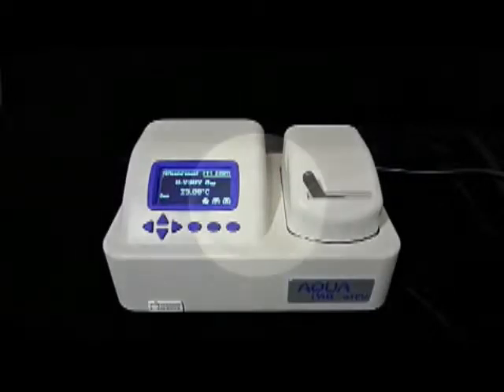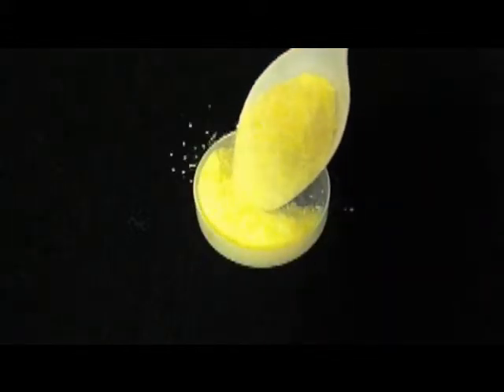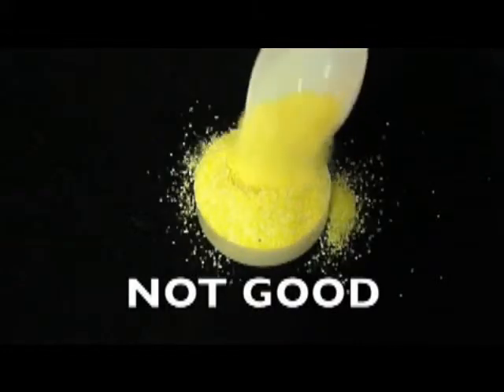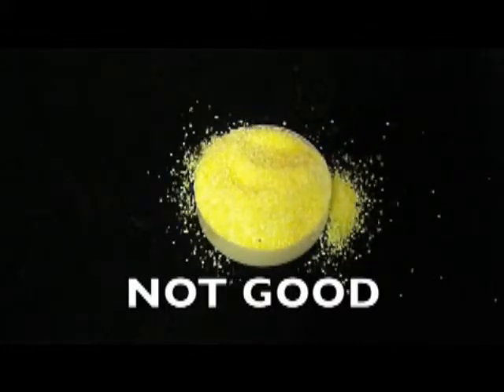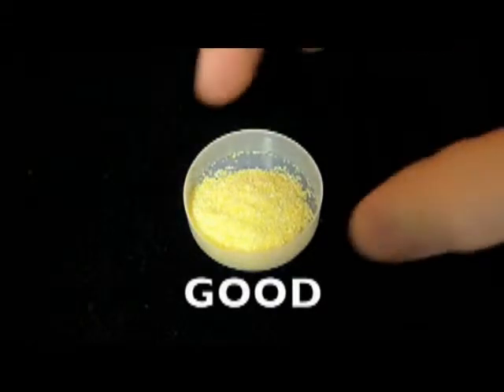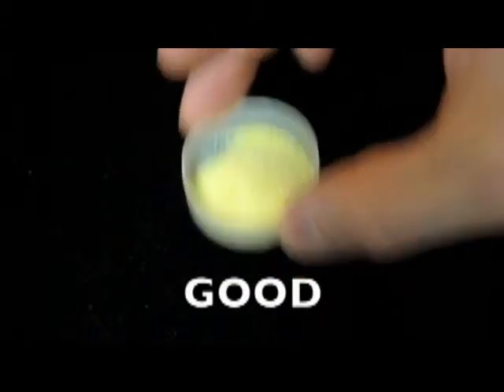While we're waiting for the graham cracker sample, let's look at how to prepare several different types of samples. Let's start with this cornmeal sample. In sample preparation, you want to cover the bottom of the sample cup with the sample material, but it doesn't need to be more than half full — a too-full cup increases the chance of spilling sample into the sample chamber. With a powder or flake, just sprinkle enough to cover the bottom of the sample cup. You can carefully shake or tap the cup to distribute it evenly. Then if you're not going to read the sample right away, seal the sample cup with a lid so the sample won't gain or lose water. Just remember to take the lid off before putting the sample cup into the chamber.